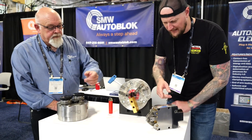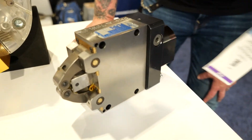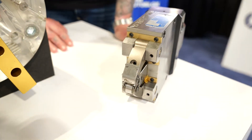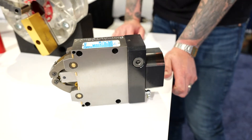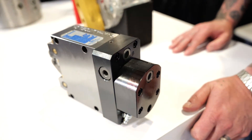And this is our steady rest. We sell a lot of these steady rests in conjunction with the shaft jobs that we do. This is our mini, so it's easier to lug around to the shows, but we go all the way up to a 6.5-inch. We do cam shafts, regular shafts, following steady rest, dual steady rest — everything that compensates the chuck on a long part that may bow in the middle when you're machining it.